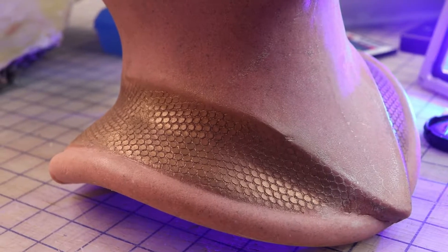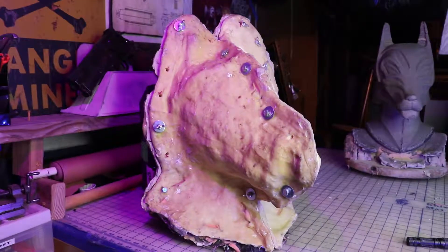This is my first pull that I expected to throw away. You can see there are little bits of clay that got captured from the casting process, but other than that, this turned out fantastic. The silicone captured all the detail of every little pore on the face, and my jeweler's cut was so effective you can't even see the seam line — other than a little bit of flashing here and there. This is the one I'm going to be setting aside if I ever need to remake my mold. And this is my first production casting, where I got a little artsy and used stone filler to make it look like it was made out of carved granite. Overall, I'm very happy — no air bubbles, no imperfections. The mold was done perfectly.